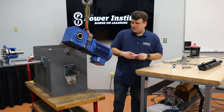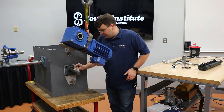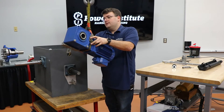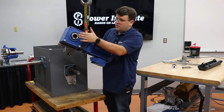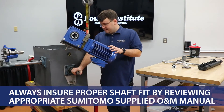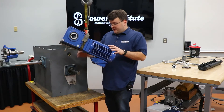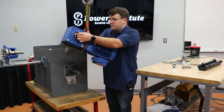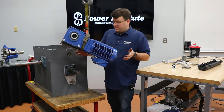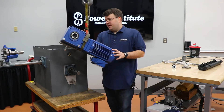The first step, as with all of them, is to make sure the bores are good and clean and the shafts are good and clean. We'll wipe them down real good where the key goes, down in the keyway. Wipe the shaft itself real good. Any dirt, debris, shipping lubricant — we coat these shafts to prevent them from rusting, so keep that good and clean. Once they're nice and clean, if you can, get the keyway at an easily accessible slot so you can put the new key in. For this we won't be putting a key in because that depends on your pulley shaft length, but the first step would be to put the key onto the shaft. You line it up onto the bore. Once we're lined up you can rotate this — you can reach in here and turn the fan to turn the low speed shaft, or you can turn this to make it match the bore. Once everything's clean and dry and you have the right key that came with the pulley or shaft, you can line it up.